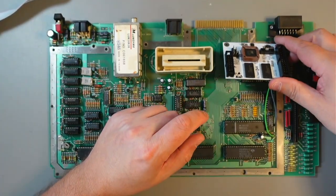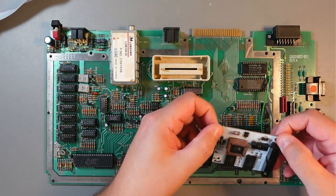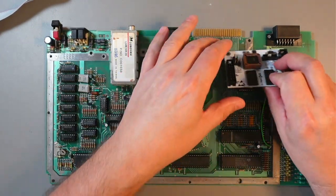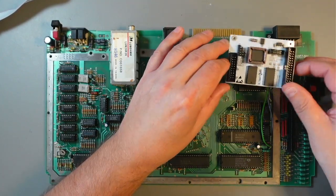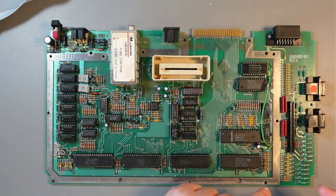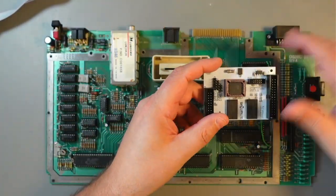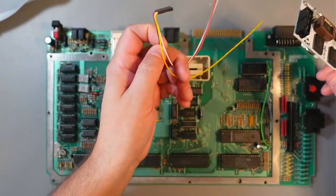So how I do that is, I have a plastic template, just a piece of plastic. Just mark these two holes, because you can't really put it here. So I'll just use thin plastic. I'll drill these holes and I'll show you how it looks, and then we'll mount this and make or modify these cables, and then solder these points there.